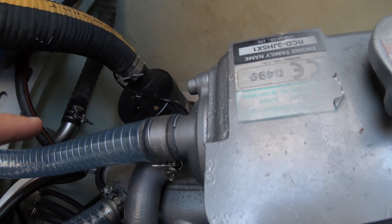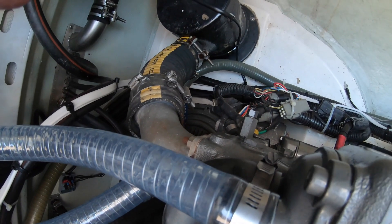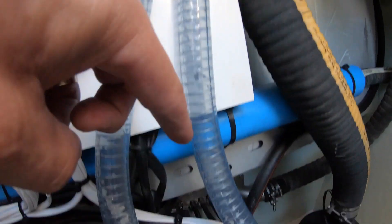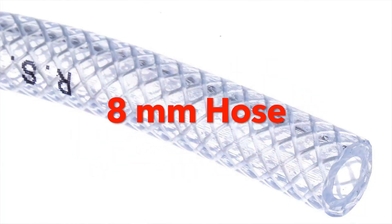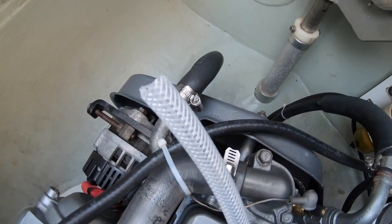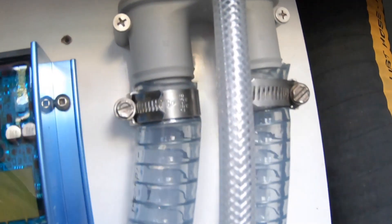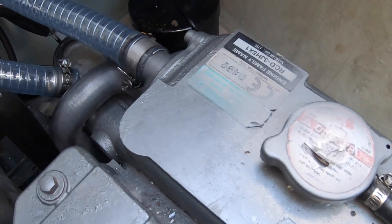The flow will go from the seawater coming in through the big pipe, up underneath, and then it will come up here to lose momentum, and then over through here. We put a little hose on the valve, which causes the water to go into the bilge instead of back into the engine. This eight-millimeter hose goes right down into the bilge. We reused the hose clamps since they're in good condition. The end of this hose is diverted so it empties harmlessly into the bilge and not into the engine. That's the end of the job — hopefully this helps prevent a lot of heartache.